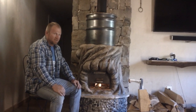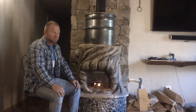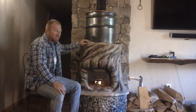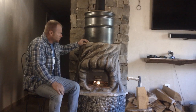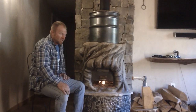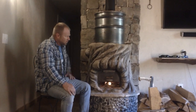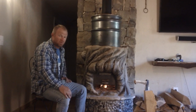In a rocket stove, it burns a very hot, efficient fire, and the reason it does that is because the air really rushes over. Generally speaking, in Ianto Evans' book, he says the square inches here should be slightly smaller than the square inches of your flue — so that's what I did here. I've already burned it last winter and it's worked great. It hasn't cracked any. I used a clay-sand mix — Hawthorne Refractory Clay, two parts to one part sand — and mixed straw in there as I built it up to hold it together. Once I got it built, I covered it in linseed oil and did a little dark areas with some dark paint thinned out to try to give it some depth. So anyway, this is the new batch rocket stove. Thanks for watching.